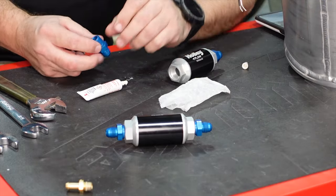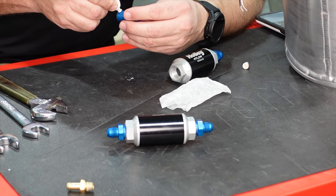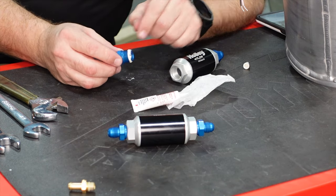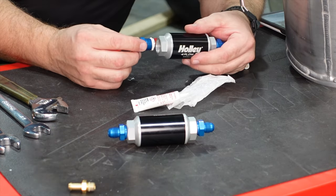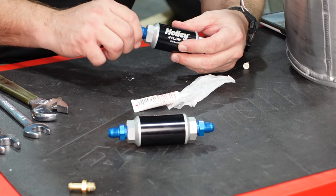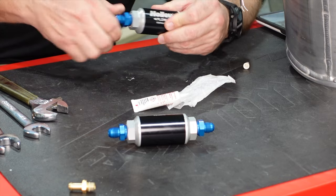All right, so just like we did on the header tank itself, we're going to put Loctite on the threads here. Like I said, it's only that first 3 to 4 sets of threads, because as soon as you start going into the fitting here, it's already coating the threads and squishing out, so you don't need to go overkill on it. Get that in there snugged up,